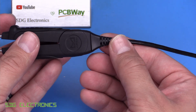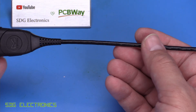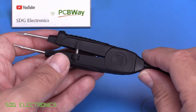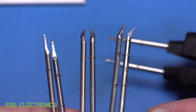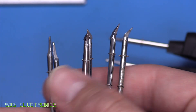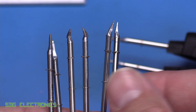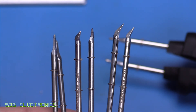There's a cord grip here and then again we've got that 3.5 millimeter coax, and this one's about two meters long — loads of cable if you have your base station away in the corner of the bench. Once again, there's a variety of cartridges available and they come in pairs for the tweezers. We've got straight cartridges as well as some bent ones, which allow you to approach at a different angle and potentially avoid colliding with other components.